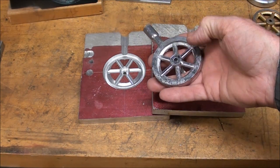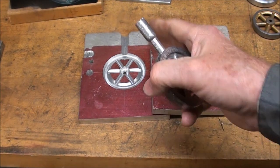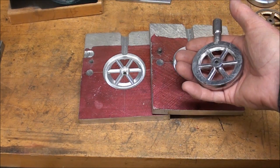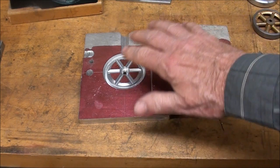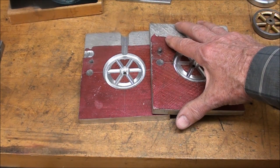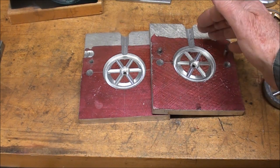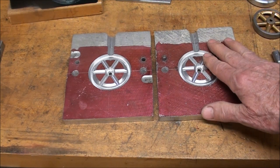This is the mold I'm going to use for the smaller ones, since I still have plenty of the big flywheels in stock. I'd like to make about ten of these — that'll last me several years. It's been several years since I did this, so I have to relearn some things. Not every one comes out perfect; I'll have some short runs and some bad ones. If they get warped when I take them out I just melt them down. Until I get the temperature regulated and the mold up to the right heat, the metal can chill off before it fills, or the mold gets too hot and the material is still slushy when I open it and it breaks up like fudge.